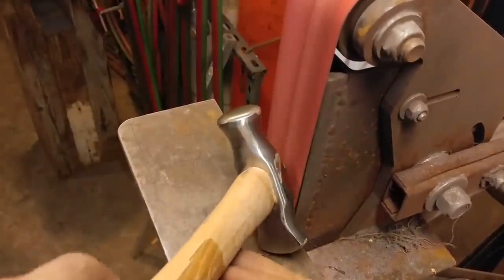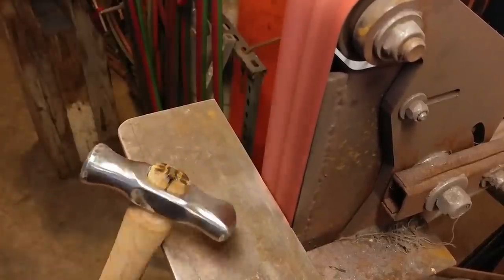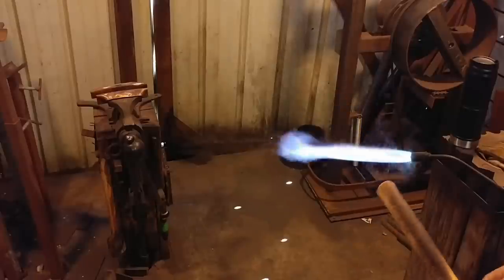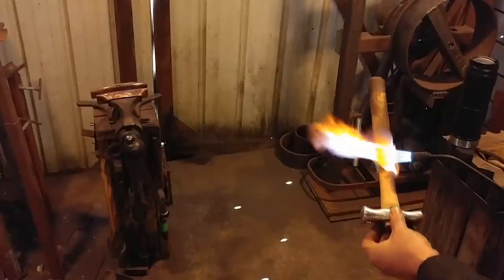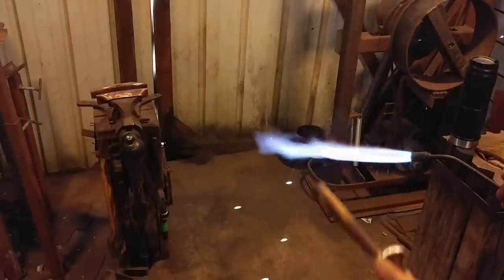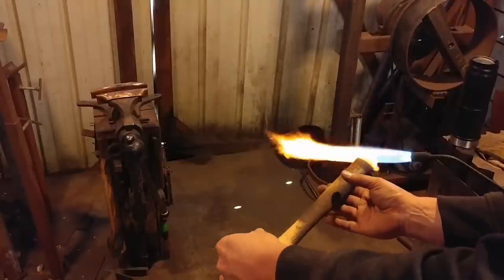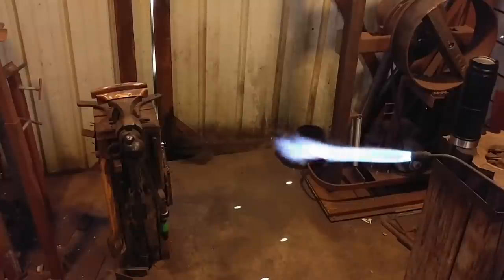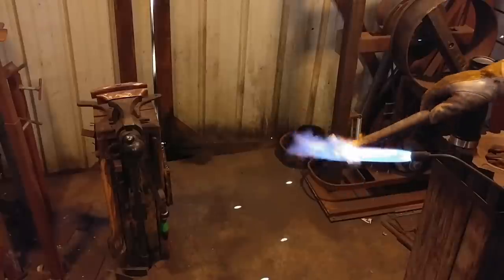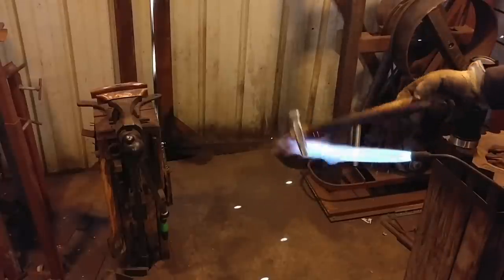It's okay if it chars up a little bit, because we're going to char the hammer handle later anyway. The main thing is to get it cleaned down so there are no snag points. This next step is completely optional — I choose to do it with my hammer handles because it gives it a little uniqueness. I've heard some people say the Japanese would do this to seal wood fibers and preserve the wood. I don't know how accurate that is, and maybe someone who does woodwork can comment below, but I mainly do it because I think it's a nice aging effect on the wood.